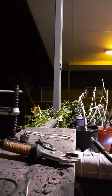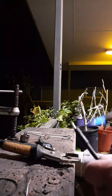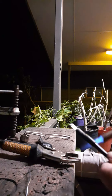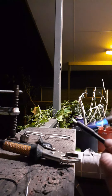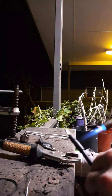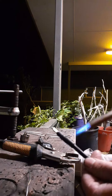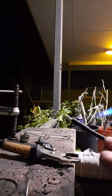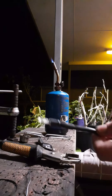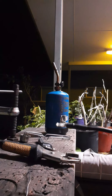You know you've done a good join if you can see the glue come out either end. This just stops corrosion from getting to the termination. I use tin cable here and solder, and basically once you see a bit of glue come out either end, you know you've done a good job. This one is going to be used on the Minn Kota connection. Cheers.